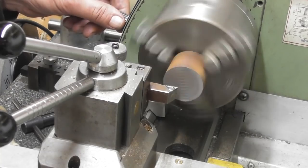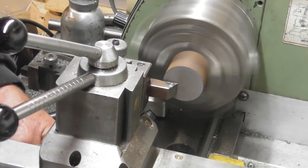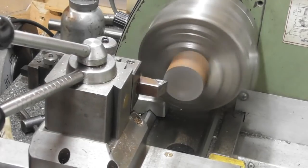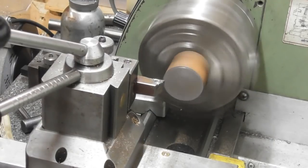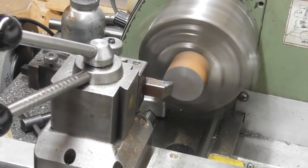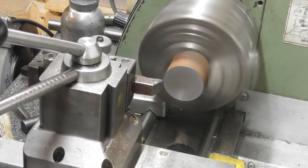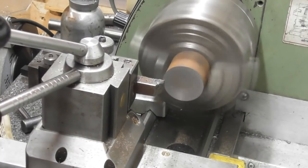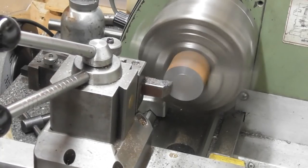As normal in these circumstances I've got this piece of cast iron that was supplied. We're going to find out what it's like — it's a stock bar. I'm going to have to get the lathe good and clean when I finish this, get rid of all the cast iron. But as with all these jobs, first thing: it's a sawn size on here and I'm not expecting a skin on it, so we're going to face it off.